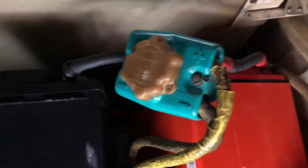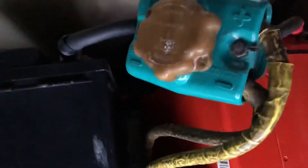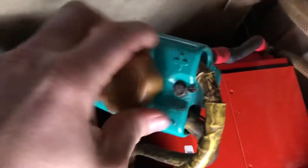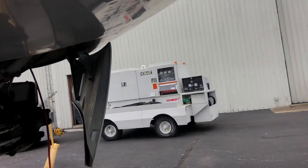I'd just like to show you how to disconnect the battery on the 737 — it's extremely simple. We have this Elcon connector: just grab the knob, push to the left, it unscrews, and pops apart just like that. At this point there is no DC power being supplied anywhere to the aircraft, and we have already disconnected the ground power cart, so no AC power either. So we're safe to put this aircraft in storage.